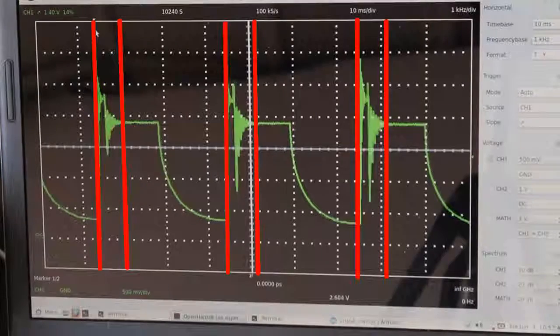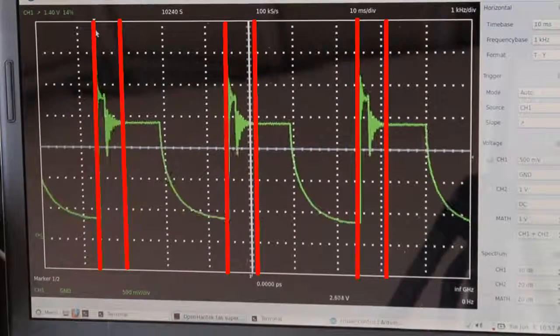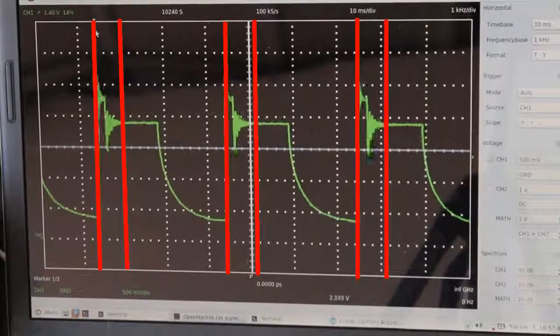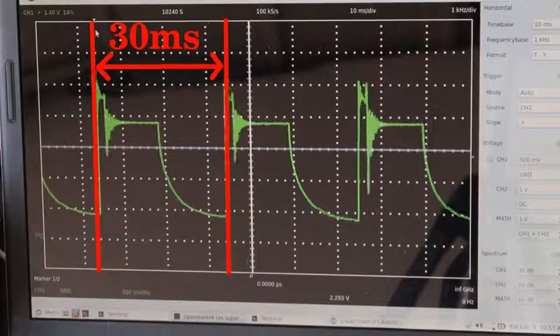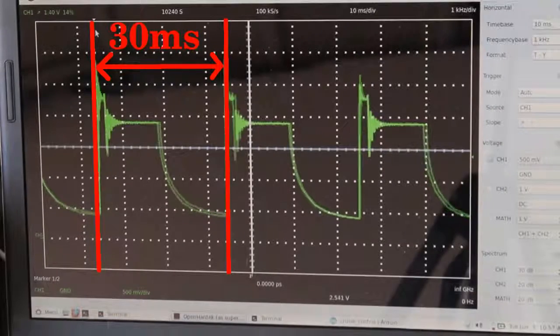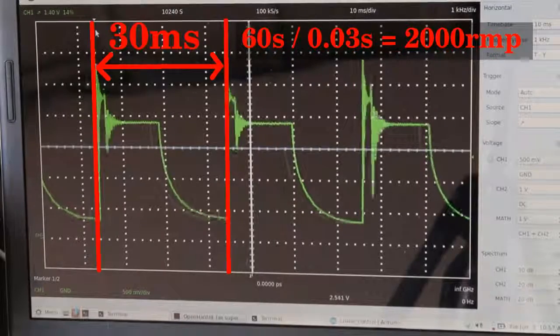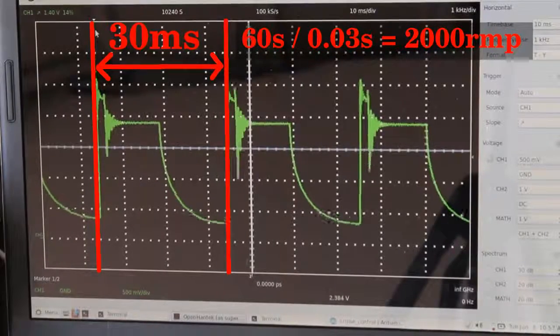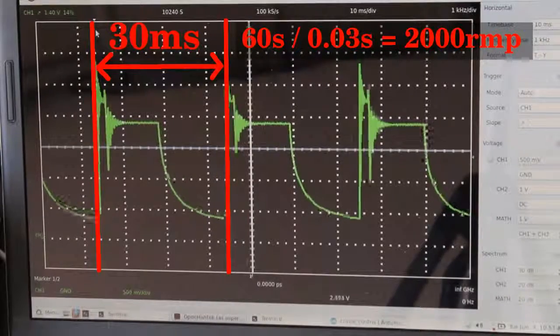A high signal is accepted not until it lasts for more than 1 millisecond, thus the noise at the beginning of a transition is ignored. There is one pulse at the digital input of the microcontroller each revolution of the combustion engine. The number of pulses per time interval is equal to the revolution speed. You remember the sensor disk?